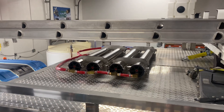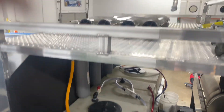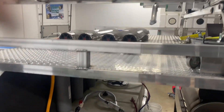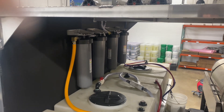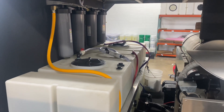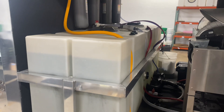So again, that's going to process through the first filter — the carbon and the sediment. It's going to run up top here to the roof and right through these four RO filters. It's going to come back down and finally end up through those two DI filters. Then we'll direct it either to our 400-gallon tank capacity here, or to the hose reel holding our water-fed pole supply hose.